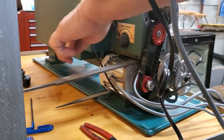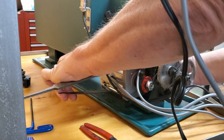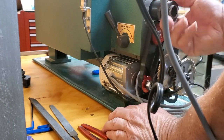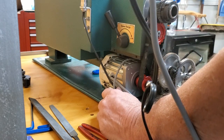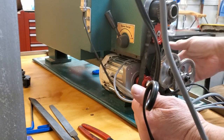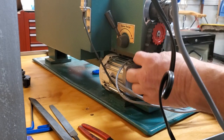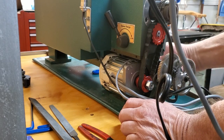Place a flat file or a flat bar here and another one there. Rest your palm on this, get your fingers underneath, and lift up. Snug these bolts in the front — that's what causes the motor to tip in the right direction. After you get that right, check how close the belt is to this surface. The belt should be just about touching that surface, maybe even touching it. If it's too far one way, loosen the allen screws and use a small block to tap the motor until the belt just touches or just stops rubbing.